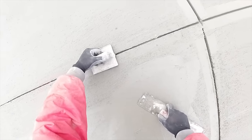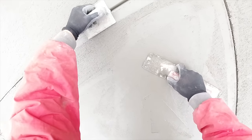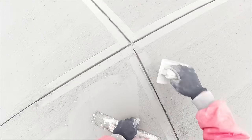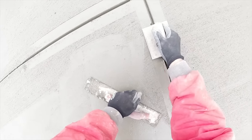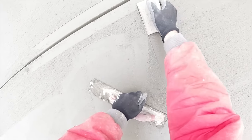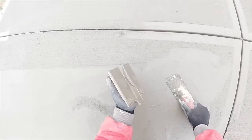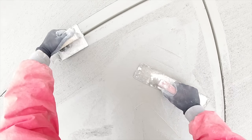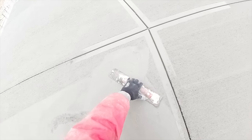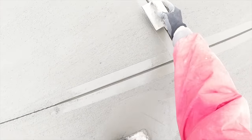I feel it's important when you get to these intersections, really take your time, put a lot of effort into making these intersections nice and clean, opened, trued, straight, and shined up. Want those edges nice and full, no holes or gaps that dirt and de-icers can settle in and deteriorate the concrete. The tighter you can get these, the more durable the driveway will be in these joints. These joints want to crumble with all the sediment from the salts and de-icers laying in there. So get them sealed up as good as you can. As well as, look how nice that looks when you just put a little bit of effort into paying attention to the corners and making sure everything's nice and full, nice and closed up.